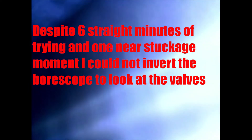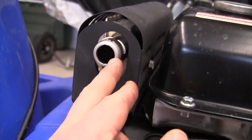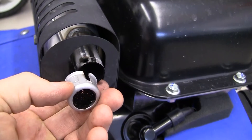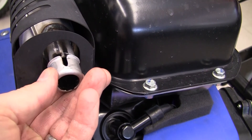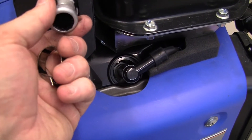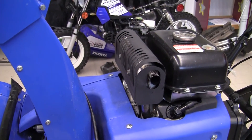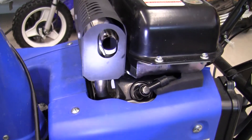Here we are trying to turn around — I've got a bunch of it shoved in. As a small bonus, we're going to inspect this muffler screen and see what's in there. The screen comes off with a pair of pliers — it's stuck on there pretty good. Once you get the clamp off, you have to twist it off with channel locks. Looking inside, we can see that the soot accumulation is not bad at all for four years.